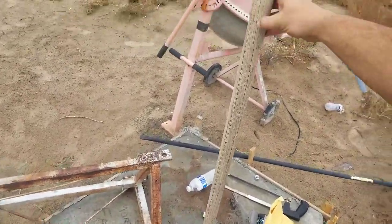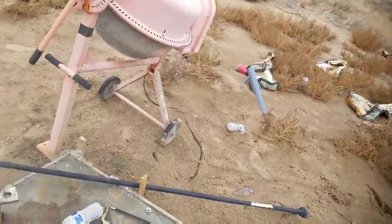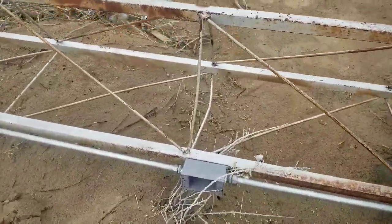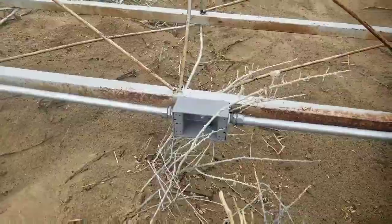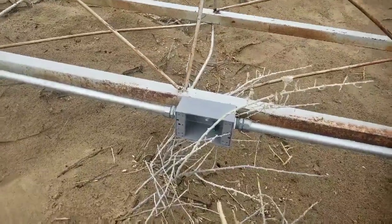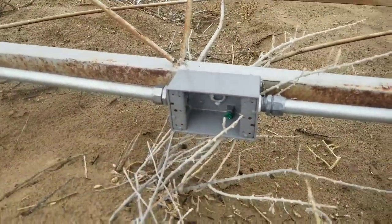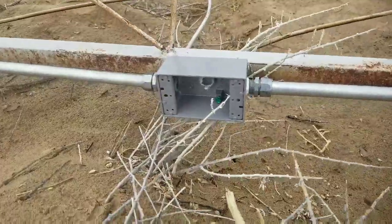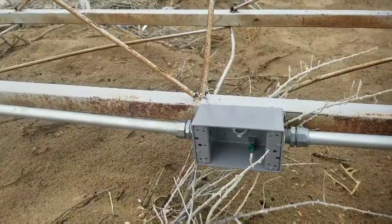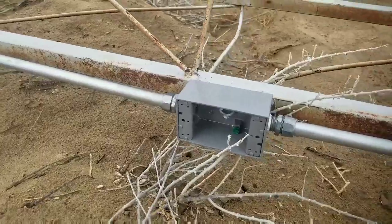Four feet off the ground will be where that switch starts. What we're doing is Dad's sending fish tape, which is an electrician's fancy tool — basically just like a nylon cord that you attach the wires to, and then you pull it back through, and it allows you to fish the wires through. You're almost here, Dad. I can hear it echoing through the system.